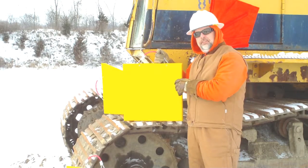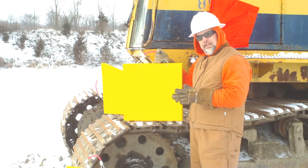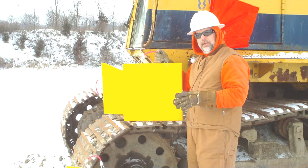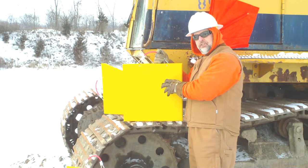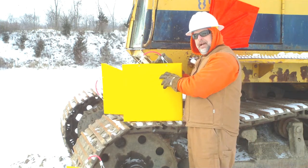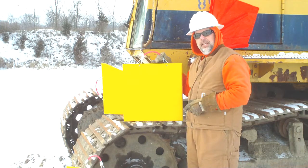What makes the Outdoors for Life outrigger pad different is several things. First, we manufacture every one of our pads ourselves in the United States. Everything we make is in high visibility yellow for safety so employees approaching an outrigger area can see the trip hazard. We texture all of our surfaces so they won't be slippery in snow or rain. We provide a stainless steel wire rope handle with stainless steel fasteners. We engrave the company's name onto every outrigger pad for free. And we make every pad the size that you, the customer, want — not the size that we have in stock.